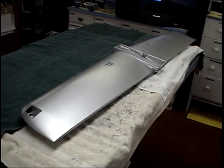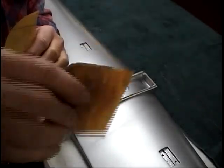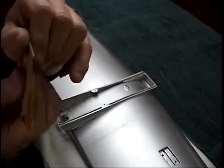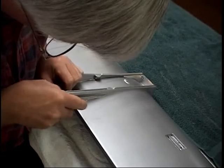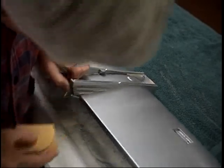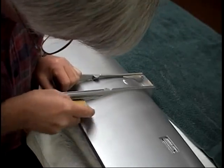Here's another little tool I found real handy: I took one of these little trowels and stuck sandpaper to it to cut away at the bad spots. That gives you a real razor edge to work off. Down here in these fillet grooves this has really been useful - I should have had this when I did the original assembly. By the end of this project I hope we've worked out all the kinks of making strakes. The reason is we may want to make another ship with strakes in the cowling, and figuring out the easiest and best way would be part of what I'd like to get out of this project.